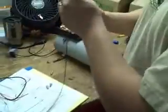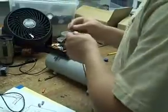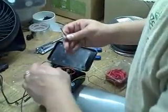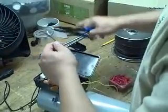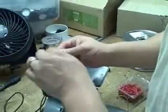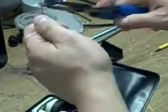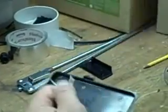Okay, so now we've got our water pump, basically the same as we were before. And we're going to run that cable through the same hole that we drilled for the other water pump earlier. Okay. This is about all you need. Okay, that's plenty. I like to tear off the sheathing just to make it a little easier to work with the wires. Otherwise, it becomes kind of a pain when you're trying to put them in the wire nuts later. So do whatever's comfortable for you. After you do it a couple dozen or hundred times, I'm sure it'll get much easier for you.